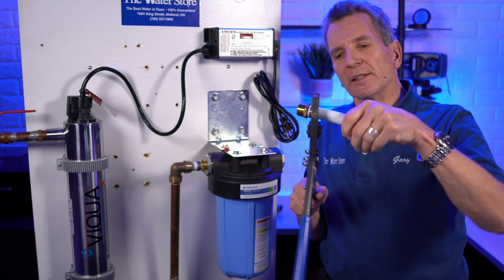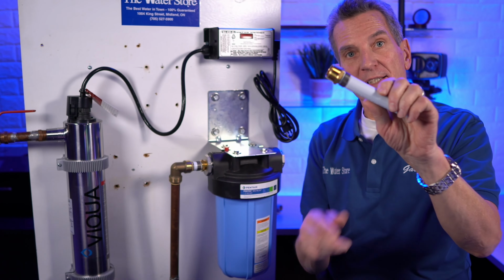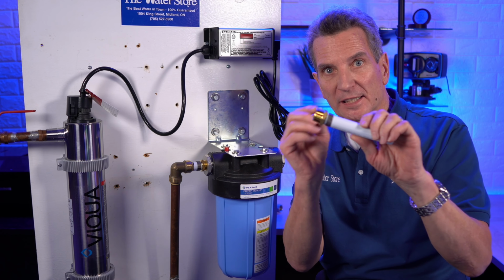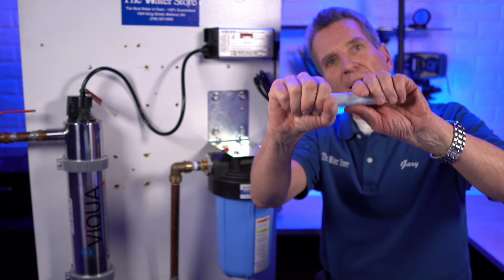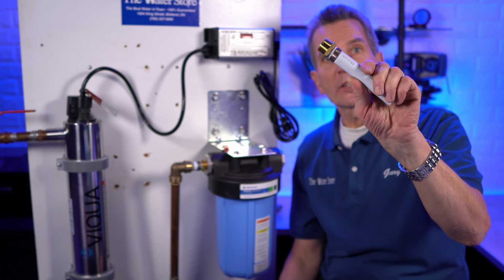And that's what's crimped it. So one of the advantages of using PEX, obviously, is that it's very easy and it's very quick. You don't need to drain every last drop of water out to be able to solder it. And actually, once the fitting is in, it can rotate slightly if that's something that you need. So that's a great way to do that.